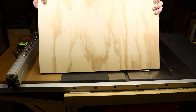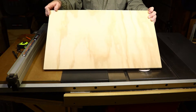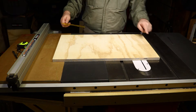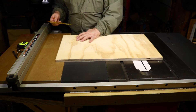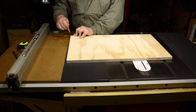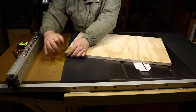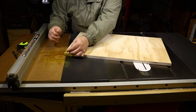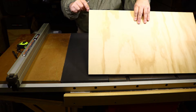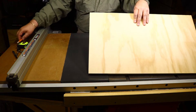I will cut that out with the jigsaw since I don't have enough clearance on my bandsaw table to make that cut. I'm going to mark half-inch rounds on the corners to soften them — that way it doesn't hurt as much if I bump into it, and the curve is small enough that I can just do that on my oscillating sander without using the bandsaw at all.